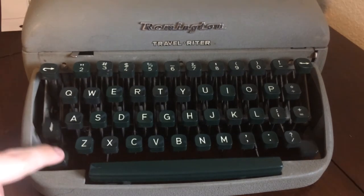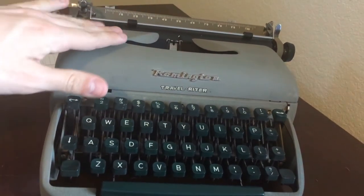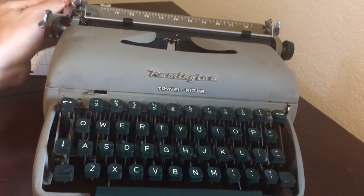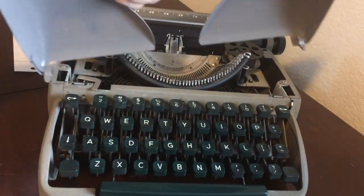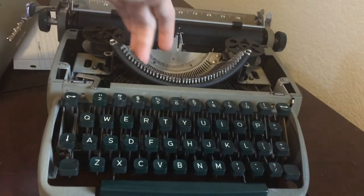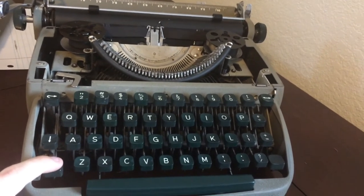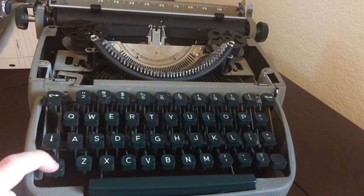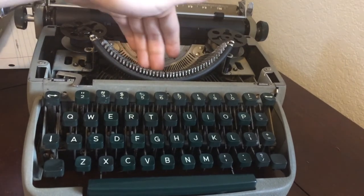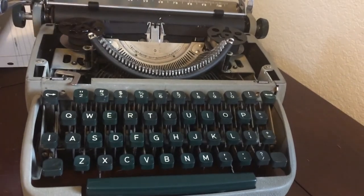On the left side we have the shift. As you might notice, it is a carriage shift. The top does pop off — just like that, it comes right off and shows you the entire inside. This is the first typewriter I've shown with a carriage shift, or possibly the second including the electric typewriter from episode 2. With the carriage shift, when you shift, the carriage — this piece right here — will move down and back up.